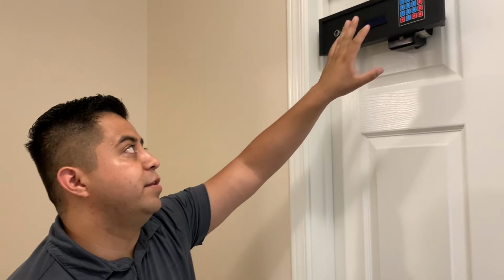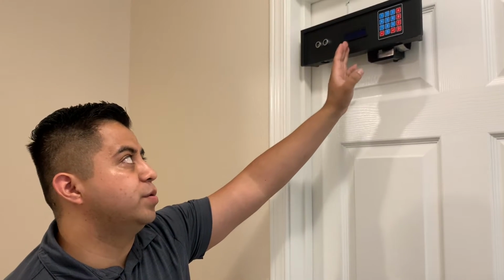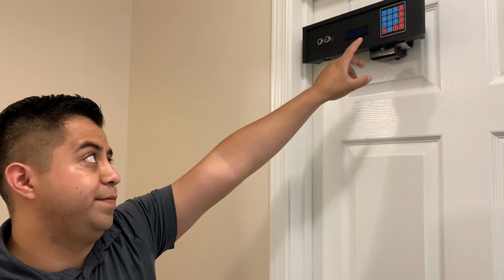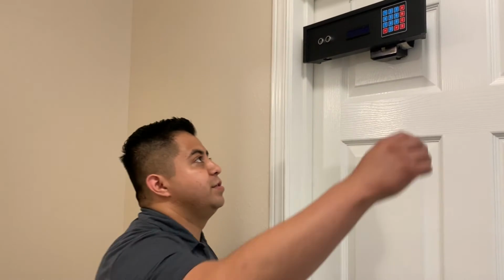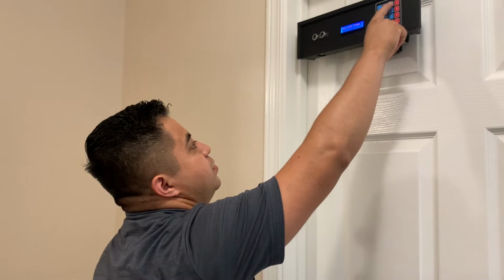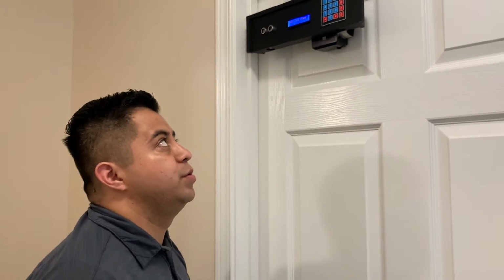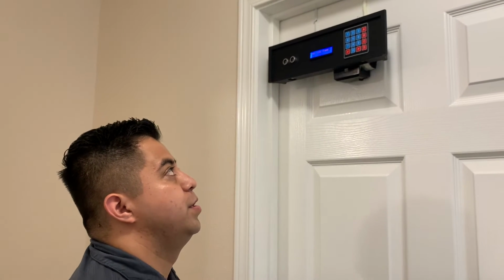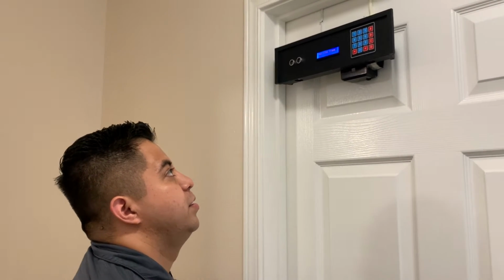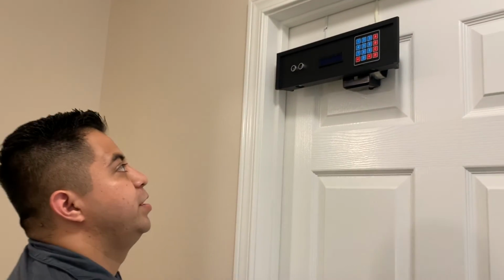I'm using this display as a security feature that will display if the door is closing, and it will say how long it is waiting to close the door, either 5 seconds, 10 seconds, or 15 seconds. I'm using this keypad to allow the system to change the time I want to wait. I could press 1, and it waits 5 seconds, number 2 will allow us to wait 10 seconds, and number 3 will allow the system to wait 15 seconds until closing the door, or remeasuring if the door is closed or open. So right now we're going to use 1, just to wait only 5 seconds.